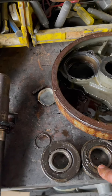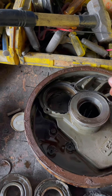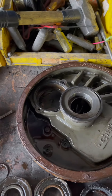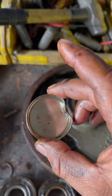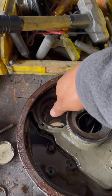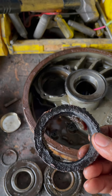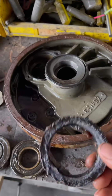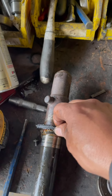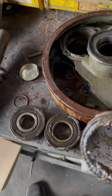So the sign that it's time to service is when you start getting oil drips into your dough. It's because the oil seal tends to break or expand and then oil finds its way inside. Oil also finds its way through this cup. The oil seal is not holding the oil anymore, so the only way it's going to go is out and down — that's why you might see oil dripping from the shaft. This area will be really wet, and that's how you can tell there is a leak. This service needs to be done to correct that issue.